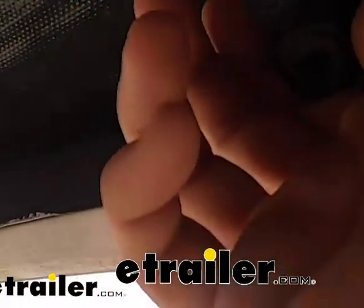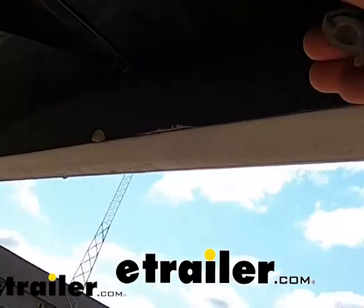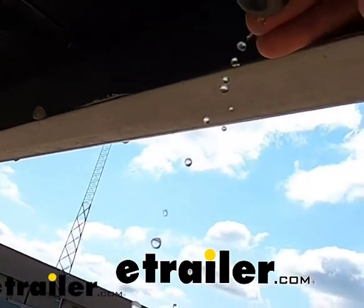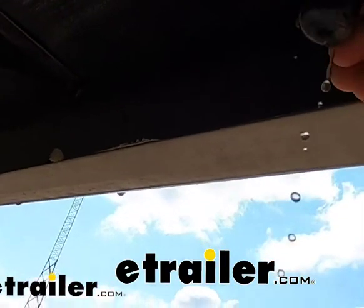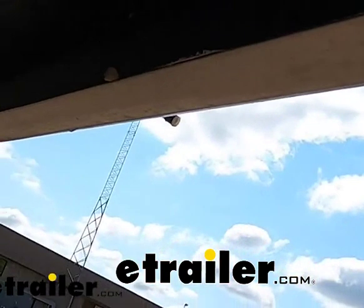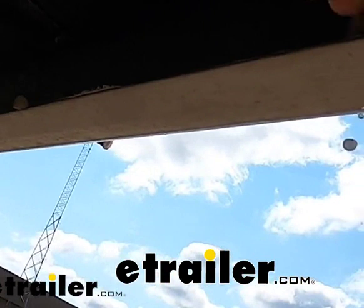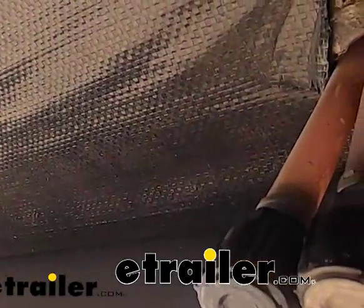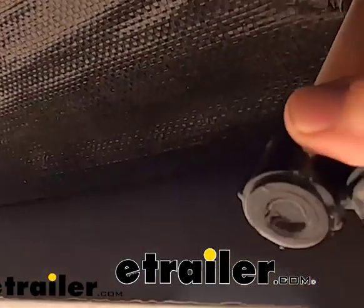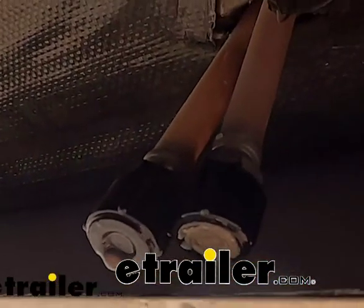So we'll want to empty these. Mine are just twist off, so you can see it's draining there. Try not to get it on you. And you want to drain that until you see the pink liquid coming out. So you can see there, that one turned pink. And then we'll empty our other one too, until it also turns pink. So you can see it running down the hose. I'm not sure if you guys can see that. There you go. You can see they're both pink now. You should be able to smell it if you can't see it, but you should be able to see it with that bright pink color.